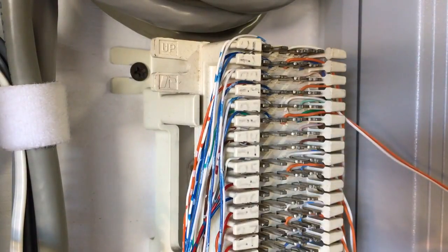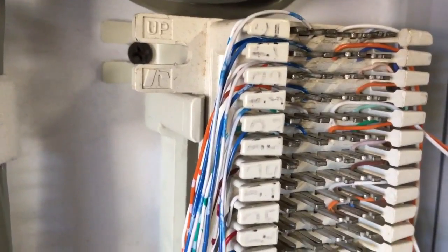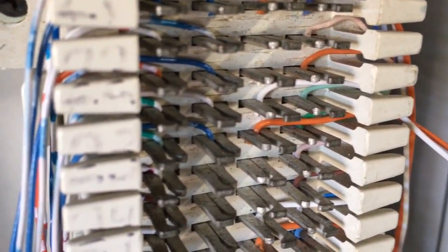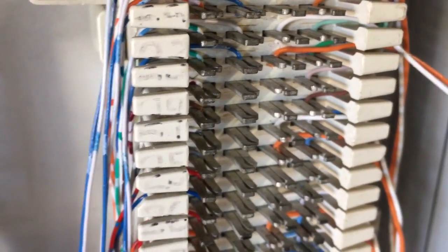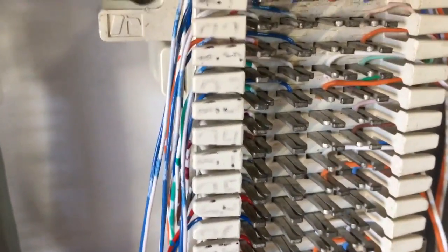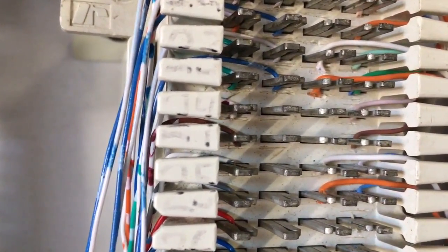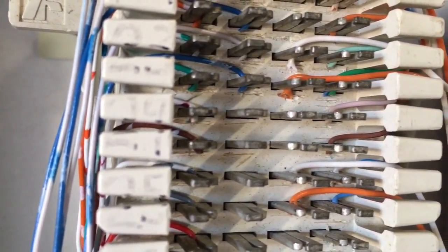I'm going to move in real close so you can get a good look at that — I apologize in advance because I'm not sure how close my iPhone can focus, but I've found the iPhone gets in close better than my Samsung Android. There you go — you can see those two pins right there, the ones I just did. If you look at the bottom of the white and orange wire, notice there's not much sticking out beneath the pins — you don't want anything more than just a millimeter or slightly more than that.